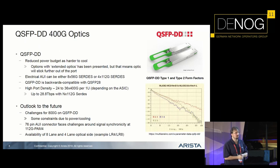The problem with QSFP-DD, as mentioned in several other presentations already, is the power budget — how much you can put through a QSFP optic — because it's just hard to cool. There have been options presented with so-called extended optics, where you have a heat sink in front of the port, which makes the optics stick out a bit more. The electrical interface on those optics can either be 8×56G PAM4 or 4×112G PAM4. 112G is currently still in development, and there are challenges to get the signal synchronicity on the electrical side. So it's nice that it's backwards compatible, but it's really hard to look into the future with QSFP-DD.